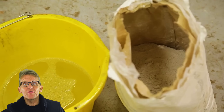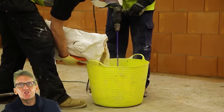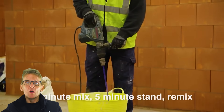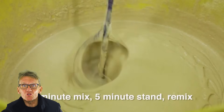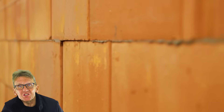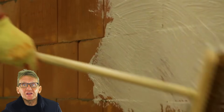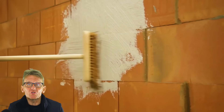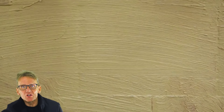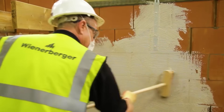One thing about damp: these are porous, so they allow the building to breathe — they're vapour permeable — provided you've got something on the outside which is also vapour permeable or will allow moisture to escape. Bear in mind that porosity also means you can get problems with rising damp. I've seen a lot of this in Spain particularly, where they just build off the ground and then they're surprised a few years down the line to find rising damp — even in a hot country, because of evaporation wicking more moisture up from the ground.